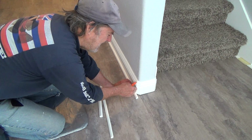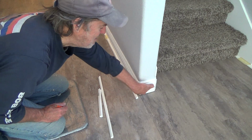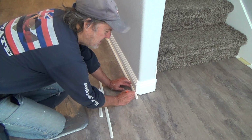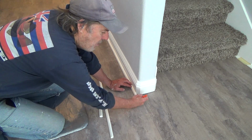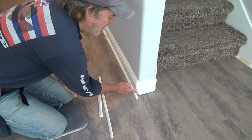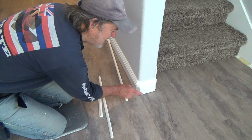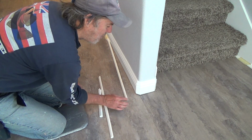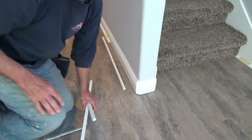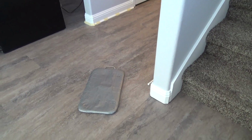Okay. Now I have to cut that at an angle, and remember, see, this little piece goes across here and then back, so that's at a 45 to the front, and so this angle has to be half of 45, which is 22.5. 22.5 corner, and then cut here, and then a 22.5 cut on this next piece just to fit that one. You see what I mean? So bear with me. Okay, there's the first one. And now this one over here,